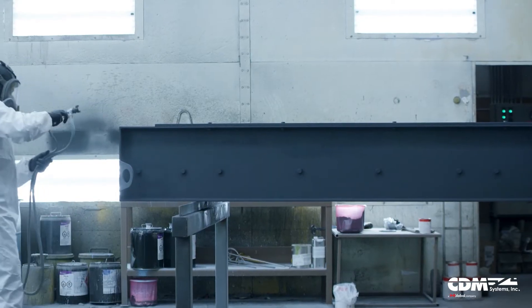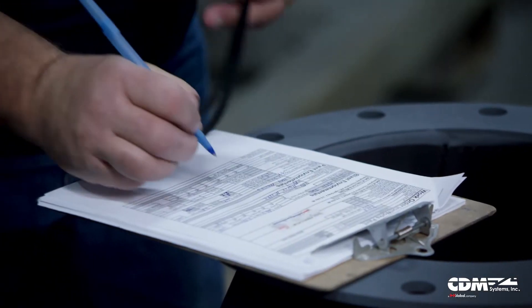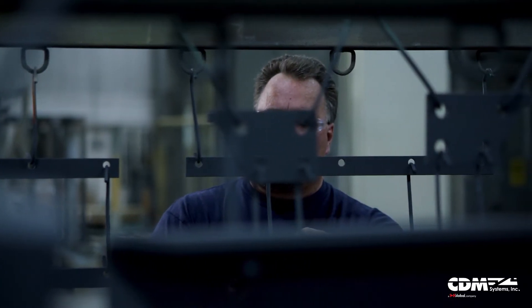It's used for personnel safety if we're dealing with higher temps — 300 to 400 degree exterior temperature on the conveyor — it allows them to do a touch temp and meet OSHA standards. Or it helps keep heat in the product. Depending on the process, it may be advantageous for the client to maintain that heat in the product and not let it radiate out through the conveyor.